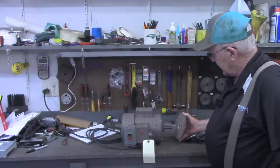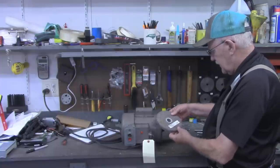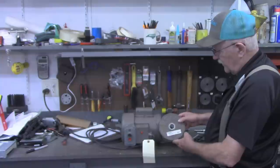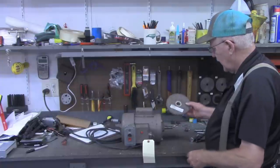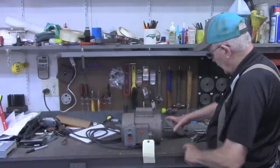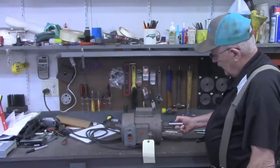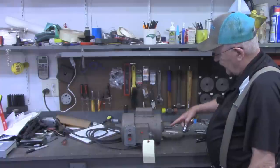What I'm going to do today is adapt this very coarse Scotch-Brite wheel. This is a grade 5A CRS, a half-inch thick. I've got one of these mounted on another motor over in the dirty side — it's coarse enough it actually throws sparks on steel. I have a piece of one-inch round stock here, it's three and a half inches long. What's going to be involved is boring one end of this out, about an inch to an inch and a half, to where it will slide up on this 5/8 shaft.